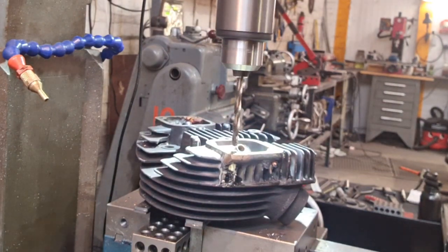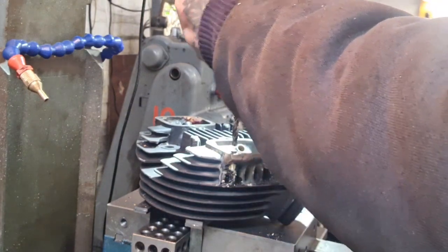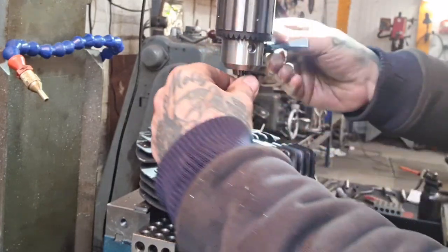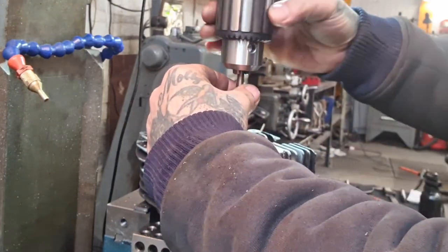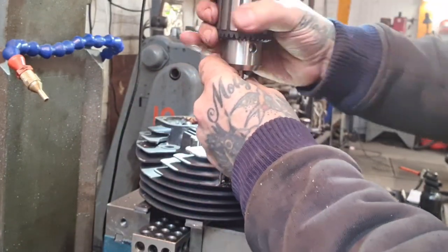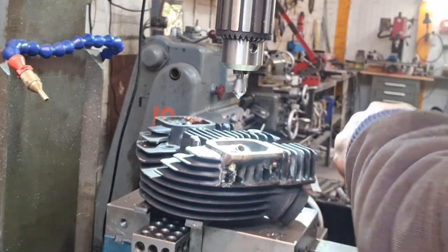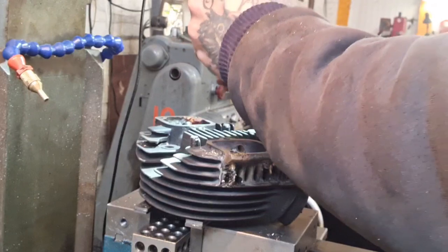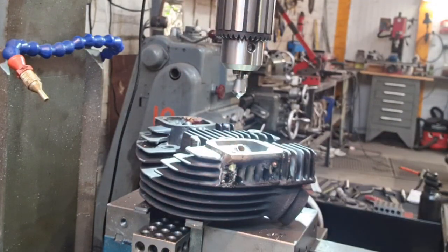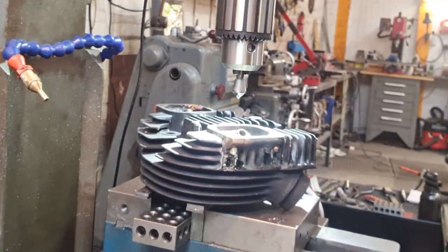And then to give ourselves a lead in for when the machine tap turns up, machine taps, because you know it's going to fight one, we use a countersink tool, a lot of hand cranking to get it where we need it to be. But we'll put a chamfer on there. Cut myself to pieces doing this job with these sharp edges. Bear with.